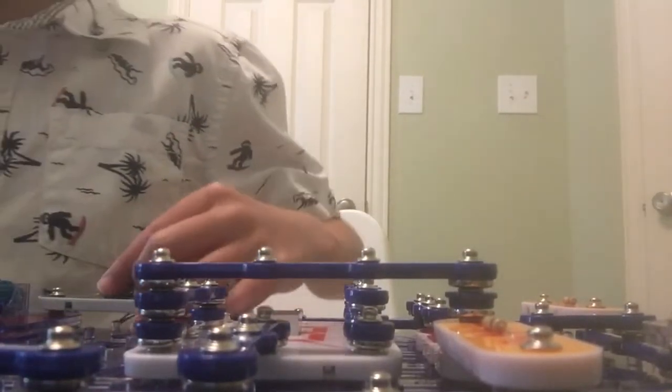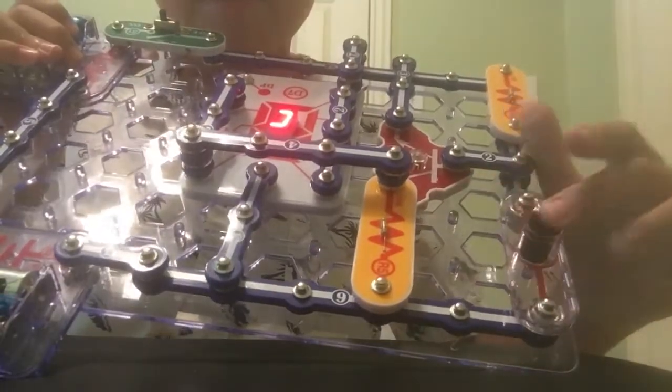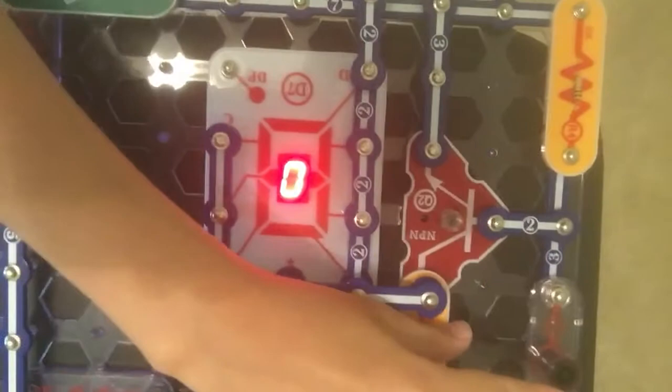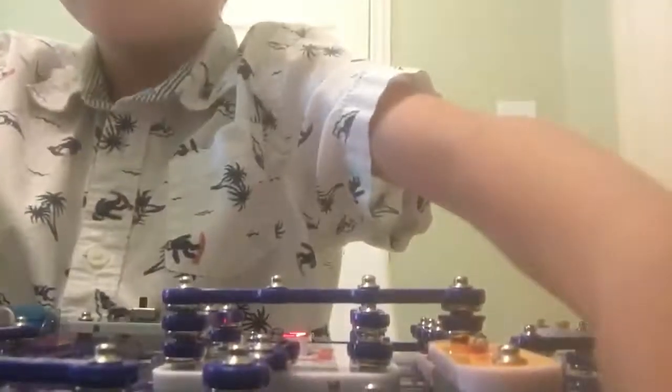So what are you supposed to do? Switching from letters O to C requires turning off segments B and C. Turn on the slide switch — it says O right now, indicating an open door. Now I'm going to cover the photo resistor — see, it says C, meaning closed. Whenever I set it down I'm going to pick the phone up to show you. You can see it says O — that means open. I put my hand over the photo resistor and it changes to C. C being closed. Now let me switch off the light in here and see how it changes. It says C now and it's very easy to see.